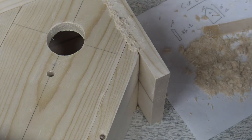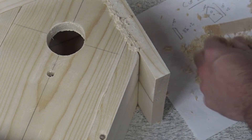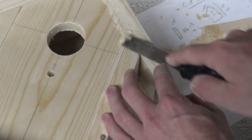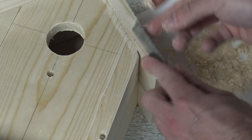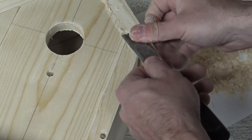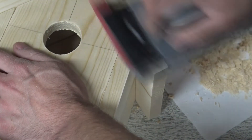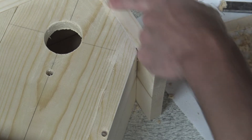Most of the boxes didn't have any cracks whatsoever, but this one lined up a little funky on us. Just take your putty knife, remove any excess that you might have. You can see there's still a couple spots with a little bit of a crack, so just fill it back in. Do that really well. And it's always good to sand right afterwards because any dust that you get up will help fill that in a bit. The line has pretty much disappeared, and once we have our latex over that, you're not going to see that line at all.